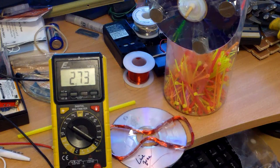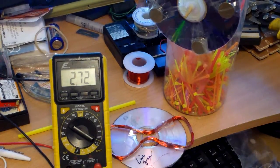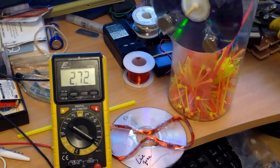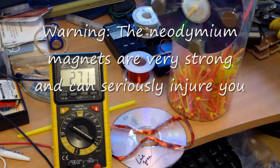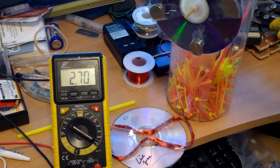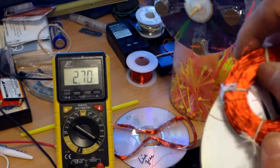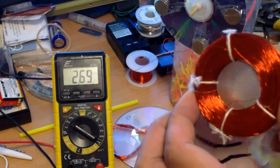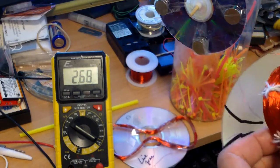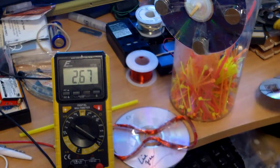Here I am still experimenting with the type of coils to make and how to arrange the magnets to get the best results. Of course you can use very powerful magnets and a lot of them and the proper magnet plate — you will need fewer turns of wire. But I am not planning on doing that, so for a coil like this I am getting 3 volts no problem. This has like a thousand turns, a lot of resistance, and no problem lighting up a single LED.